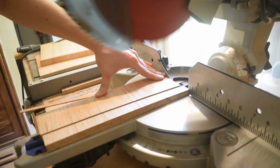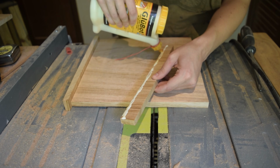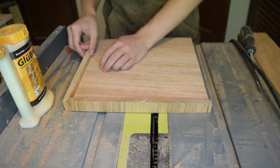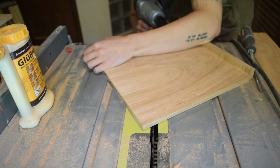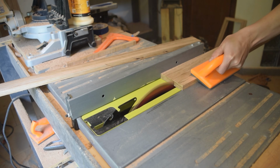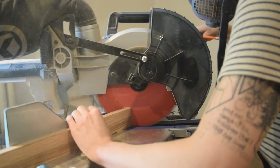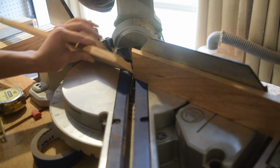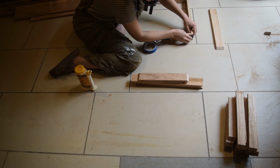Then cutting thin trim pieces to act as backing for the shelves. I secured the pieces with glue and finishing nails. With those components ready, I moved to the basket shelves for both displays, cutting 45-degree beveled edges to make the boxes. Then I used the tape tension to complete the glue up and sunk a few more corner nails for good measure.